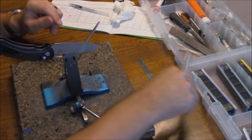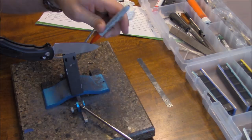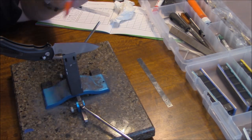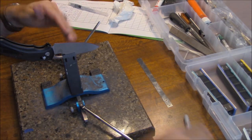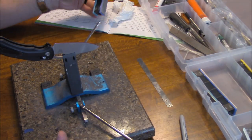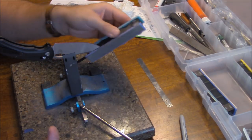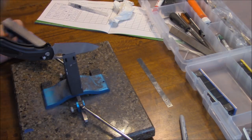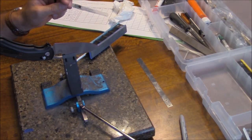What I'm going to do now is use a red Sharpie and color the entire edge on both sides, then put it on 20 degrees. I'll take my 1000-grit stones and do a couple of light passes to check. It's hitting most of the edge, which means I won't have to do too much reprofiling.